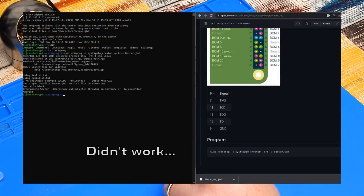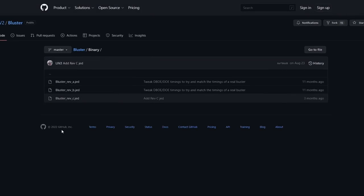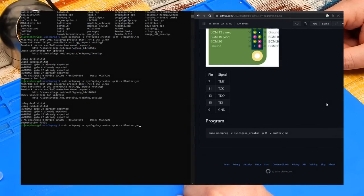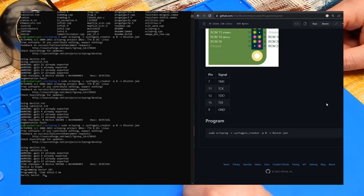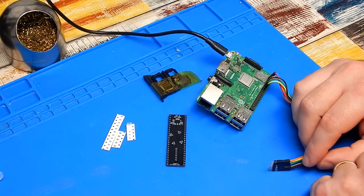I've copied the JED file to the Pi. It's powered up and wires are connected, with the red wire from pin 1 providing 3.3V. Connect to the Pi over SSH, browse into the directory, and run the command from Github. I'm holding the programmer to ensure tension on the pins going onto the Bluster since we haven't soldered it in place. After a couple of filename mistakes — it's bluster.jed not buster.jed, and you need to download the raw file from Github — with the correct file copied over it worked. One CPLD programmed.